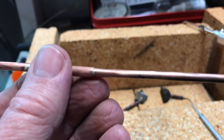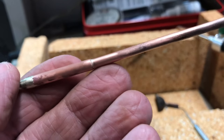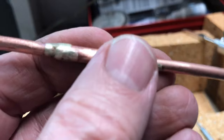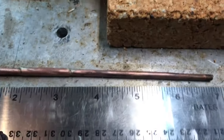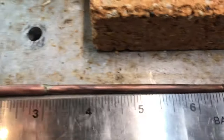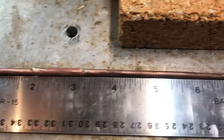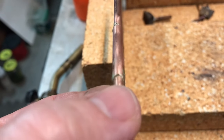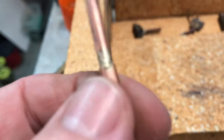Here's the finished silver soldered tube — well, I still need to dunk it in the pickle and leave it overnight. I globbed up the silver solder on there pretty good. I used Safety Silver 45, just to be on the safe side since this thing will be inside the boiler. Let's double check the finished length — it should be right at six and three quarters. Line that up on the end — yep, right at six and three quarters. I used the Dremel to clean this thing off after I quenched it, and I looked at it under my Optivisor to make sure it looks like it has a good seal everywhere. Now we'll do a test fit.